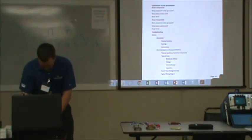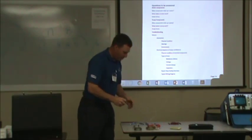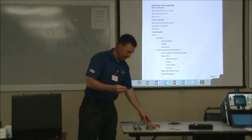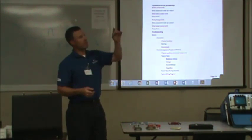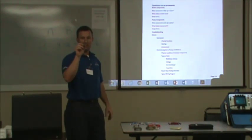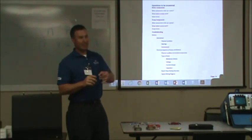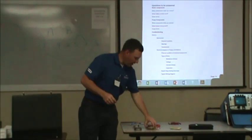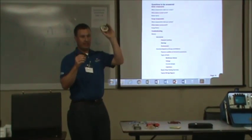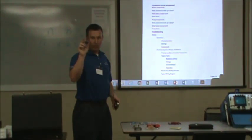You'll see here's another double row. You'll see this in a lot of submersible pumps. Double row angular contact. I brought a big one here so y'all can see. But anyways, you'll see these. All it is is a single row angular contact. This is a double row made in one.